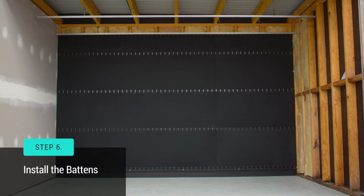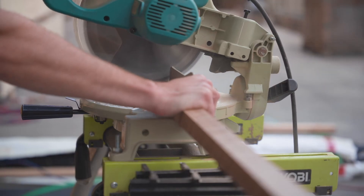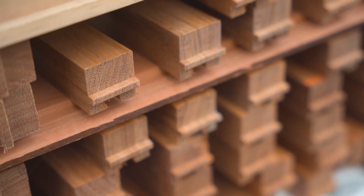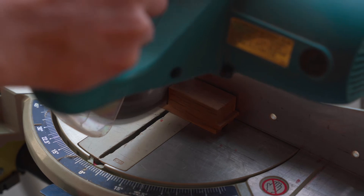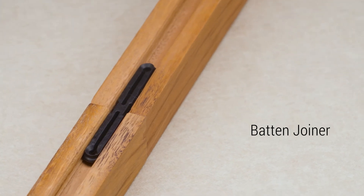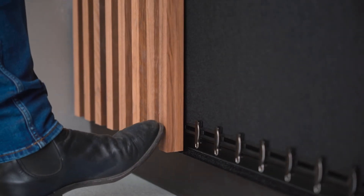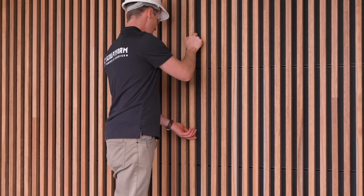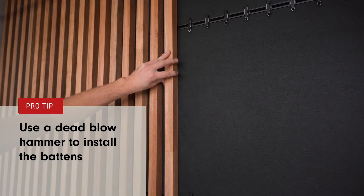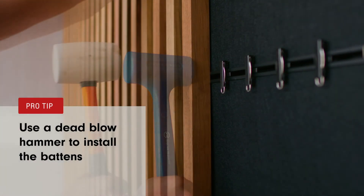Step six is to install the battens. If you're working with anything except exact length battens, you'll need to trim each batten to fit your wall. Our random length battens are supplied end matched — this end matching will need to be cut off at the top and bottom of your wall. In combination with end matching, a batten joiner is used to align the butt ends of the battens. The joiner slides into the dovetail groove at the back of each batten. To click on the battens, rest the batten on the base angle, make sure the batten is aligned with all the clips, then lightly hit the batten corresponding with each clip and work your way up. Pro tip: it's best to use a dead blow hammer to install the battens — you'll notice you only need to use a fraction of the force to achieve the same result. The alternative is a white faced rubber mallet. Continue the same process until you've covered the entire wall.